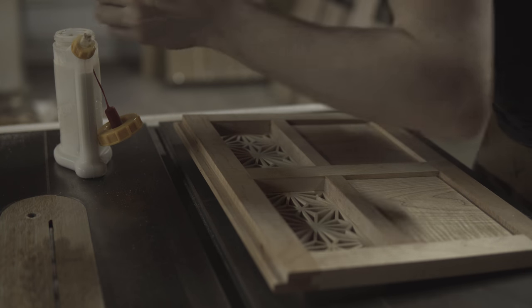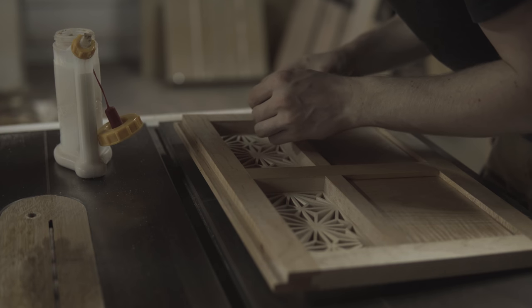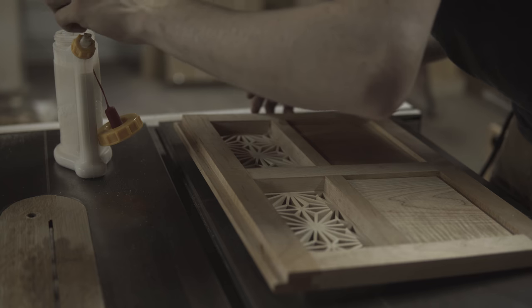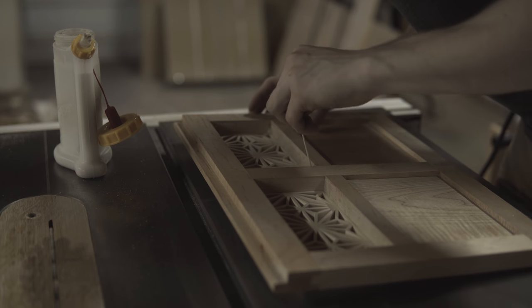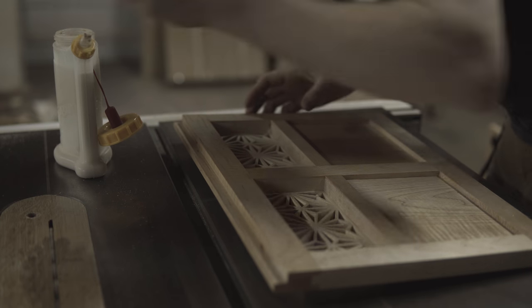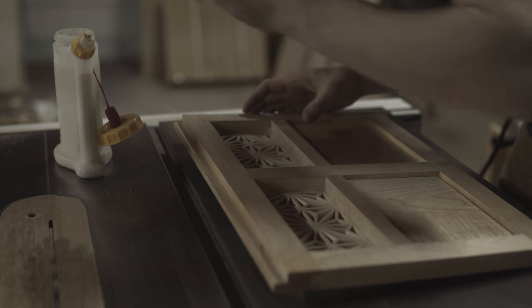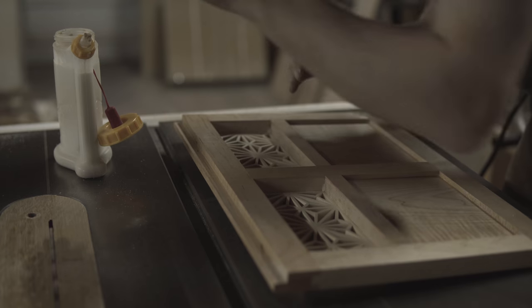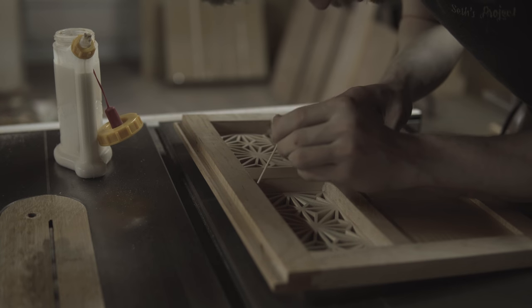So now what I'm gonna do is put some glue in the corners before I pound these panels the rest of the way in. And I'm gonna take you guys along with me here. This is it, this is the last step before these doors are done. So yeah, I'm just putting glue in the corners